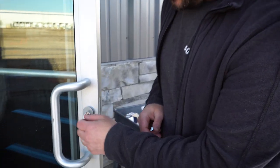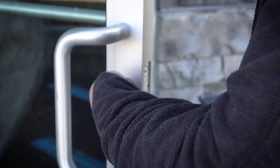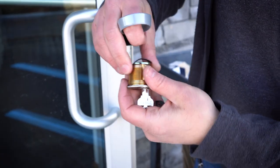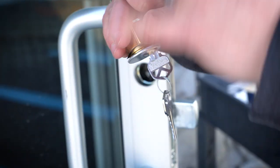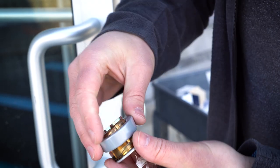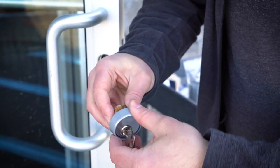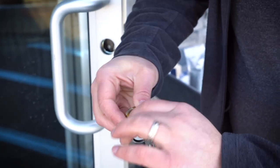Back to the security part of it — let's go ahead and put a cylinder guard on here and I'll show you how that works. We have our mortise cylinder and what we're going to do is put this wave washer on here. As you can see, it kind of makes up for a lot of distance because of the tension. Then we're going to drop our cylinder guard on here, and when that happens it makes our cylinder guard spin. So that way you couldn't put a pipe wrench on here and just break it off really quick.